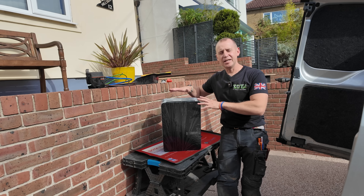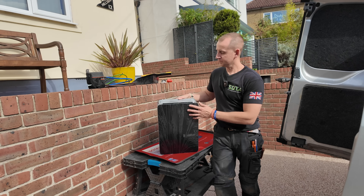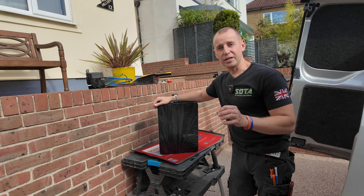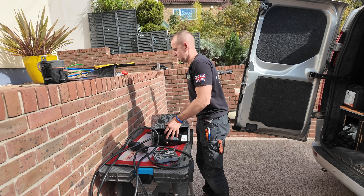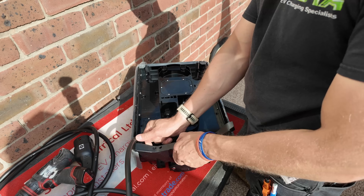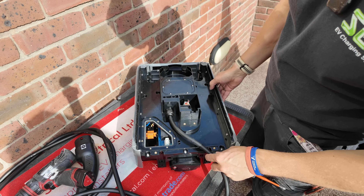This is the Anderson A3 EV charger — my favorite charger out of the Anderson range. The A2 is like a jigsaw puzzle; you're better off going with a Simpson and Partners. But this is the only charger on the market that conceals the tethered cable. For installers, this is a nice easy charger to work with — undo two screws and the front plate comes off, take off a cover, and you have access to the cable terminals. You can go bottom entry or rear entry into this charger; for this install I have to go bottom.